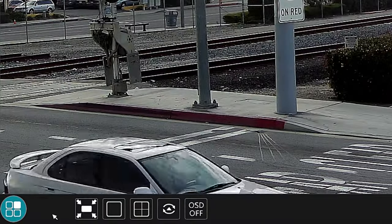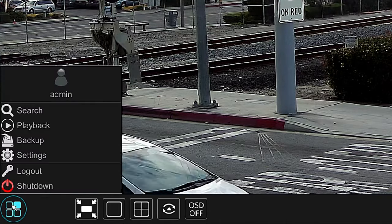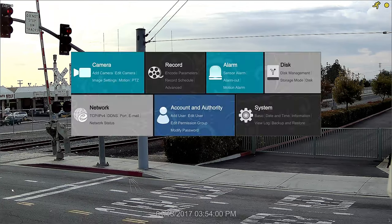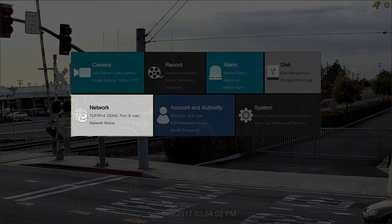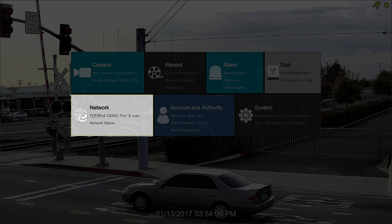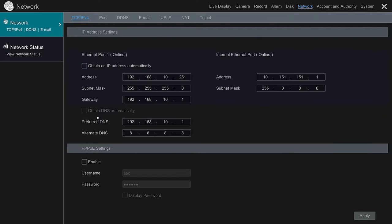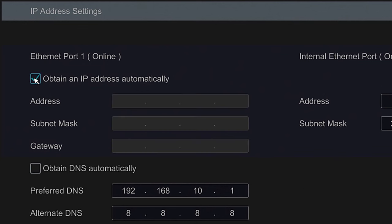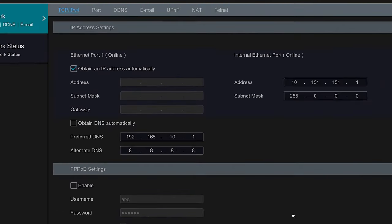Then go again to the bottom left-hand side of the menu, select Start, and click on Settings. Once you are in Settings, under the Network menu, select DHCP/IP. Your DVR or NVR may have an IP address that is not set for your network, so just click where it says 'Obtain an IP address automatically' and then select Apply.